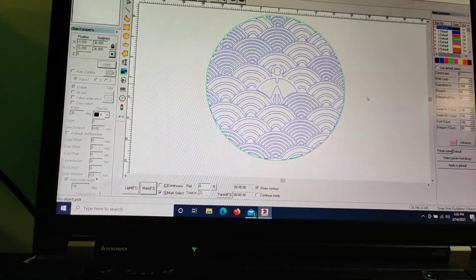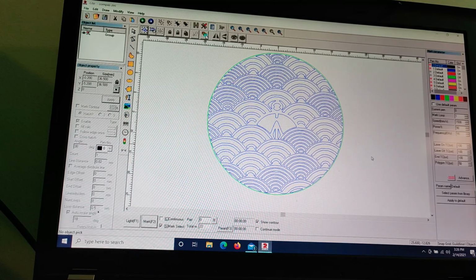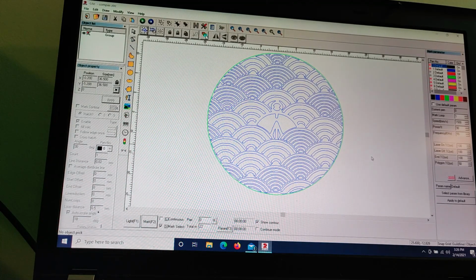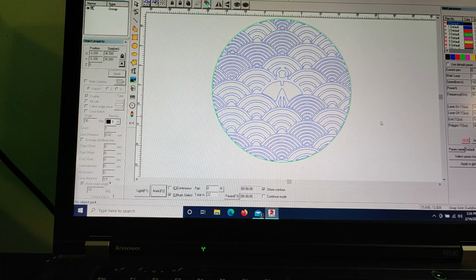All right, so let's get to some laser settings. Zirconium engraves similar to titanium, so if you hit it with high power, low frequency, it just turns into a big mess. The other thing to think about is, because it's already black, you want to kind of reverse your mind in the way you lay out your image. An engraved surface will turn whitish gray, and a surface that you do not engrave will stay black. So it's kind of like inverting it from what you're used to.